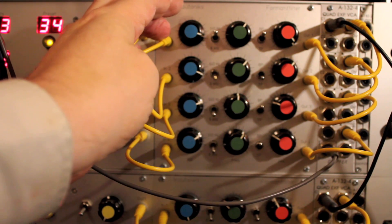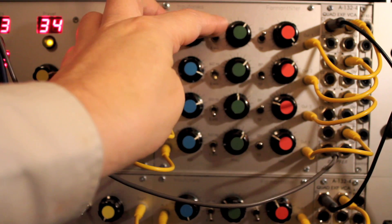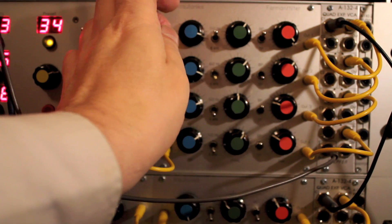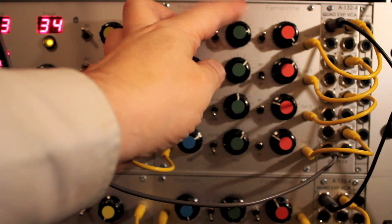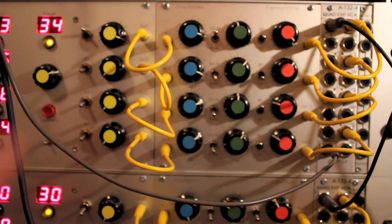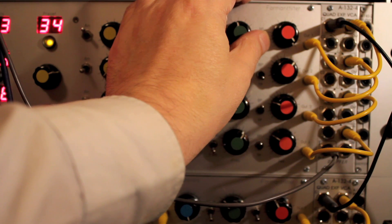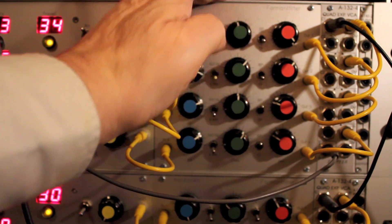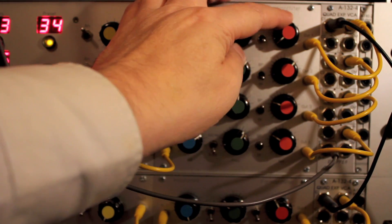They have a very simple architecture. First of all, we have an input gain stage. Next, we have a toggle switch — we can go between 6kHz and 640Hz as the bandwidth points for our cutoff frequency control. Next, we have a toggle switch where we can bypass the filter and just hear the sawtooth wave that the subharmonic generator produces. We have a bandpass mode and a lowpass mode. And finally, a resonance control.